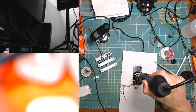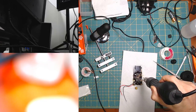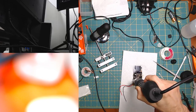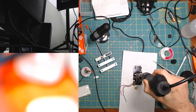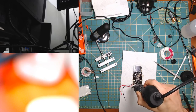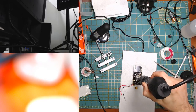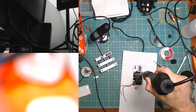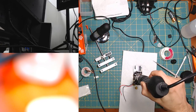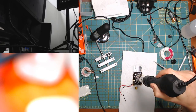You know what's funny, actually, I do have a small toasting oven that I've used to solder stuff. And it sort of works. The first time I completely fried the board, it was like dark brown. But then I actually got a thermocouple thing and made a board like this. These boards, it's kind of a pain. I can't really do that because they're two-sided. If I put components on one side and then reflow it and then try to reflow the other side, it would melt. I mean, they would desolder.